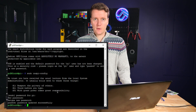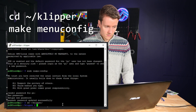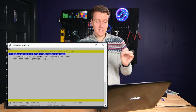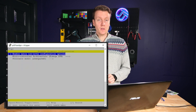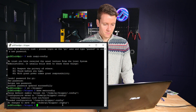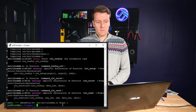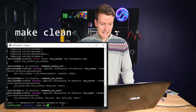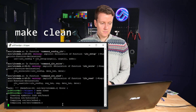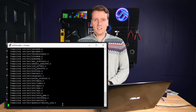Click Finish to take you back to the terminal. Now to create the firmware, type in these commands. For the Anycubic Mega S, you can leave the settings standard — it's an ATmega AVR microcontroller architecture, and for processor model this is an ATmega 2560. Hit escape to get out of that. Now type in make and it'll go through and build the firmware for you. This is the error I got the first time — I had the biggest difficulty figuring it out. The solution: type in make clean. That clears it out. Type in make again and now it will build the firmware. I'm not sure exactly why it was missing those files the first time, but cleaning it clears it out correctly.